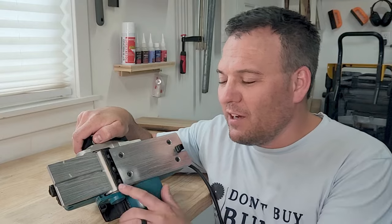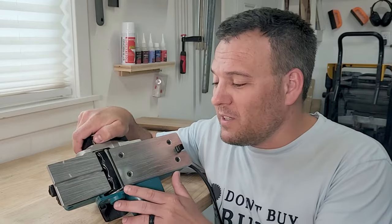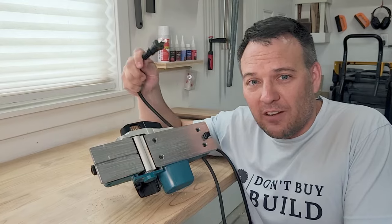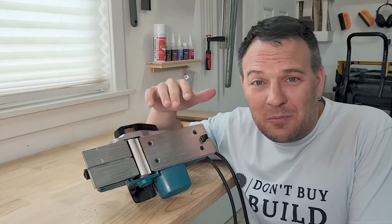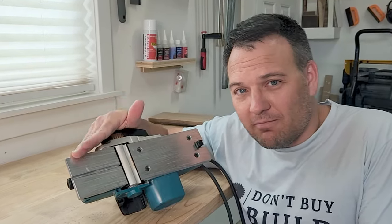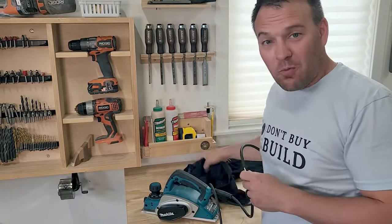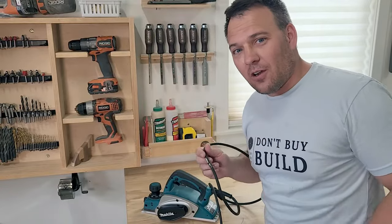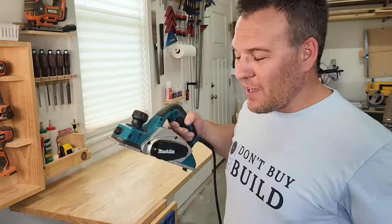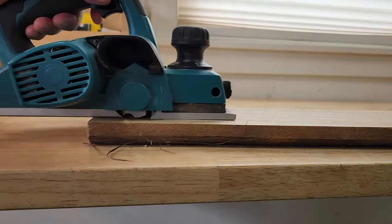While we're talking about the blade, here is the cutter head that holds two blades that are both double-sided. That way you can flip one if it gets damaged or dull. It should go without saying, but if you're going to be looking at the bottom of your electric planer, always unplug it. My Makita spins at 17,000 RPM and it removes wood very quickly — and it removes skin just as efficiently. Keep the cord away from this thing, as well as rags, loose clothing, or long hair. This small spring-loaded stand on the bottom helps protect your cutting blades and the workpiece if you set it down accidentally while the blade is still spinning. It also moves out of the way automatically when you start making your cut.